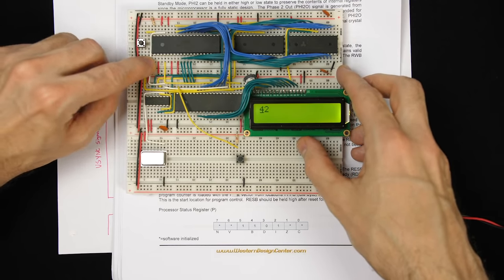Let the CPU run for a little bit, then when we get to the end of the blanking interval we halt the CPU again, and so forth. This allows us to share the RAM between the video hardware and the CPU. You might think: isn't that bad for performance if the CPU is halted 71% of the time? If we've halted the CPU 71% of the time, whatever code we're trying to run will run 71% slower. Well, that is how it's going to work. Maybe 71% CPU overhead is not usually a feature you look for in a video card, but I never claimed this was the world's best video card.